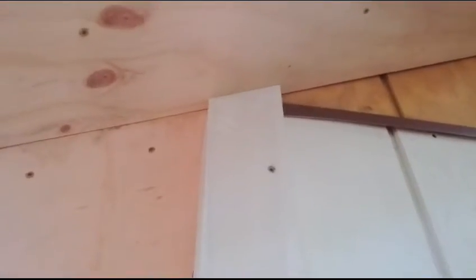So that's the first corner board. As I walk down here — I'm going kind of slow because I still don't have decking installed — here's the second corner board. What I did with the corner boards was I glued them up with no fasteners so that I could cut them anywhere. I brought it out here, I scribed to that line, I cut the angle, I primed the whole thing. The inside, outside, even the ends — the cuts are primed to try to minimize rot because it is just pine. I didn't go for treated wood. And then on the back side there are two beads of caulking on both faces, and it sat in.